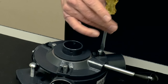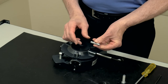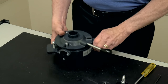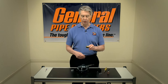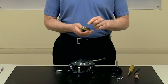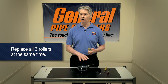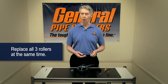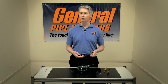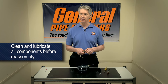Just as with the bottom rollers, unscrew the swing pin and the carrier comes right out — it looks the same. From this point, everything is the same as before. Unscrew with the 3/16 Allen and replace the roller. We recommend replacing all three rollers at the same time, because they have almost equal wear and are subject to equal forces. They have the same amount of dirt and grime threatening to get inside the sealed bearings, so it's good to replace them all — it solves problems in the future.